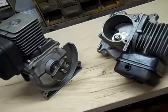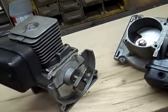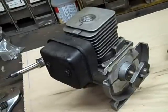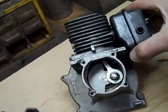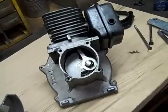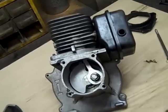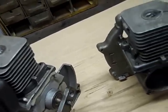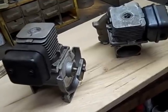Right now it doesn't really produce a lot of power — you didn't see it but I could actually stop it with my hand if I had a glove on. So if you could get more power out of it, that might make it a practical application. One of the issues with steam is that these motors are not designed to run on steam — moisture is the enemy inside a motor. These motors have bearings that need to be lubricated, and without a good lubrication system, steam really isn't practical. But like I said, it was a long winter and I had to do something. So I figured I'd try this and maybe inspire somebody to do something different. Thank you.